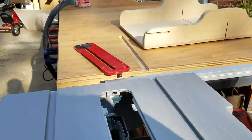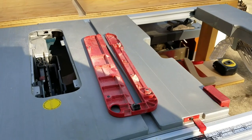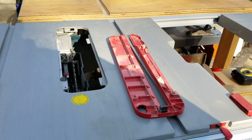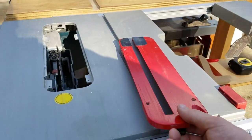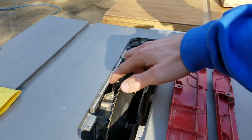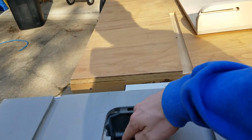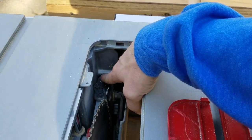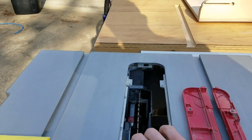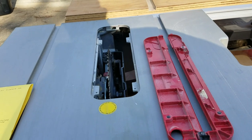The throat plate geometry is another thing I'll mention. I like to have zero clearance inserts — they make cleaner cuts for miters and allow tighter cuts up against the fence. However, it's not the easiest saw to build a zero clearance insert for. You have to cut a rabbet, and then to avoid interfering with the carriage all the way up to max cut, there are some screws that stick up — those can all be fixed by boring holes and cutting a rabbet. But compared to a cabinet saw where the throat plate fits flat into the table, that's not the case here.